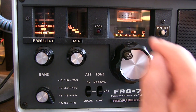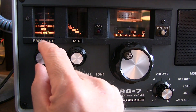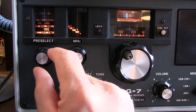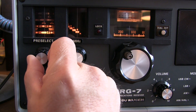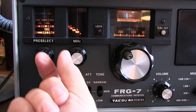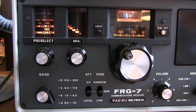Take a look at the effect of the preselector — watch the signal strength indicator. If I move the preselector, I've peaked that signal right about there — it's between 20 and 40 dB on the indicator. As we tune off, we can see how the signal attenuates and drops down. So there's a location where that signal is peaked, and now we've got the bandpass of the preselector properly centered over the signal we're listening to.